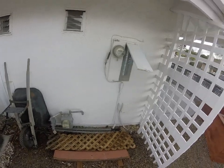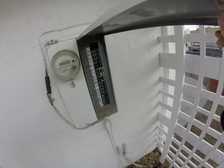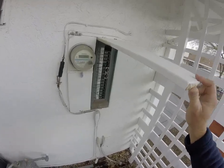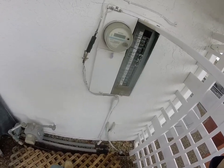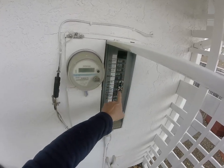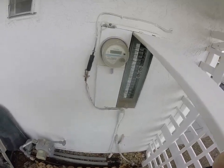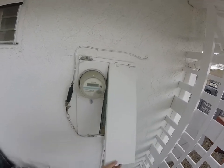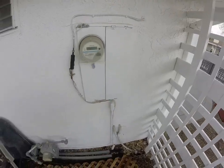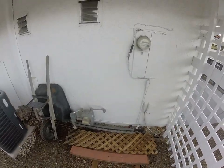We've got a 100-amp main electrical panel with a 125-amp bus bar. We could fit up to about 22 solar panels on this electrical panel — we've got one breaker space here and can make another one there. We do have enough space on our electrical panel. This is a modern-style panel; it's not one of the unsafe ones from the 50s and 60s.